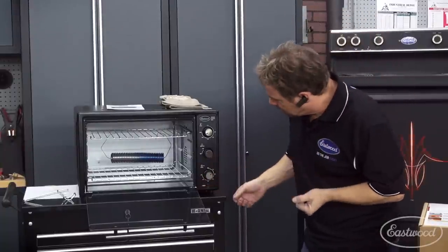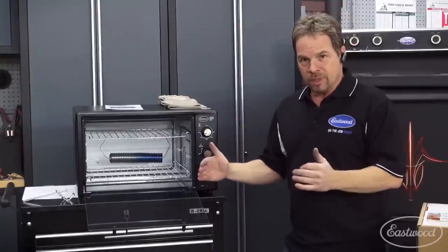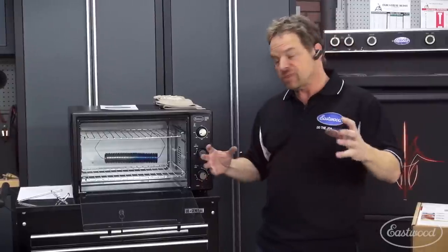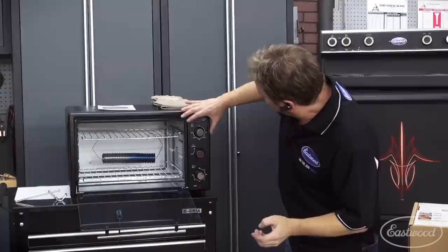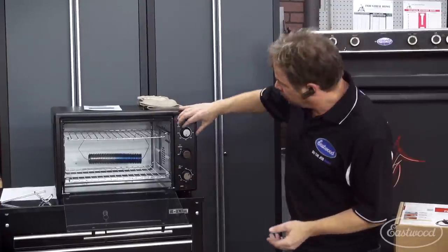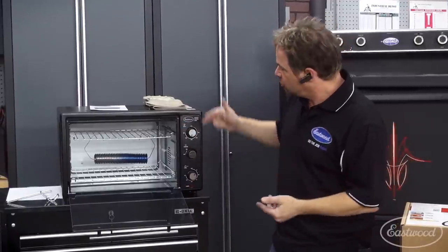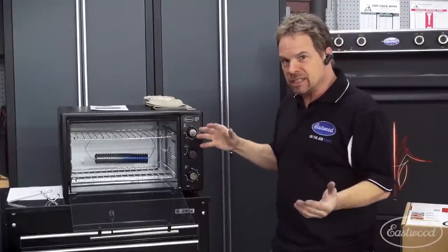It's very important to have a timer because you're timing powder to 20-minute increments for getting things up to charge, a 20-minute flow-out period, and then a cure cycle after the powder has flowed out. So the timer built in is a godsend. We've got a temperature range up to 450 degrees. Some powders, the translucents and the clears, they require 350 to 380 degrees. They don't need as much heat. So you can dial with precision right here without having to do the point and shoot guessing game.